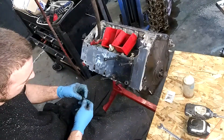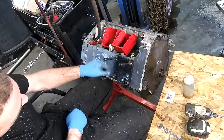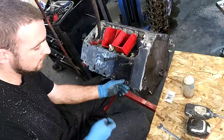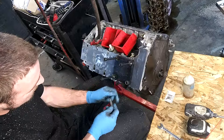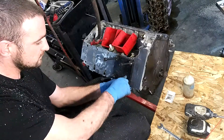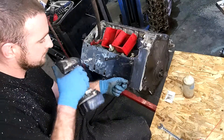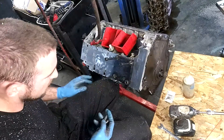There's an installation kit you can buy — it's a few hundred bucks. This one I've had for years and it's pretty well used. I've lost some of the bolts over the years that hold this plate in. What this does is it has an alignment bushing used to guide the drill into the hole that we're drilling and reaming for the insert. The other three bolts simply hold the fixture and secure it, and this pin comes with the kit and is used to align the dowel center with the bore.